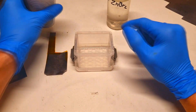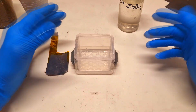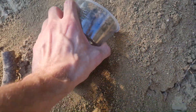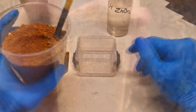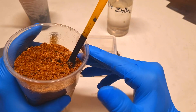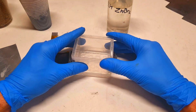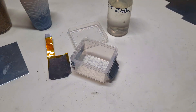This activated carbon I will add on the positive current collector at the bottom. To make the entire cell a little bit safer, I will also use some sand or dirt that I collected outside. This dirt will hold the electrolyte in place and make the cell safer. I know this dirt will add some dead weight to the cell, but here I only want to show how to make a simple zinc bromine battery.